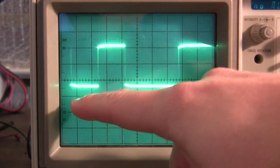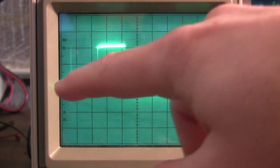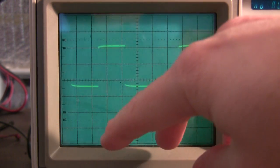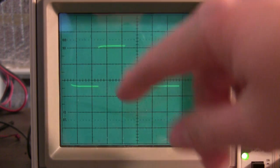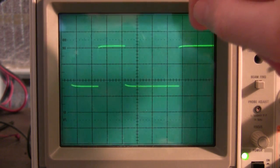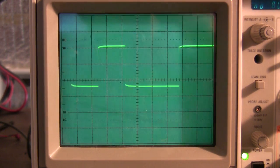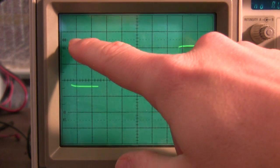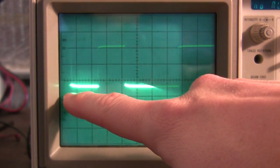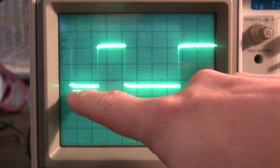So we're looking for this string of data. The first thing we get is 2 start pulses that are always high, and then a toggle pulse, a toggle bit. I'll tell you what that's for a little bit later. But all right, this first edge is our first bit, it goes high.